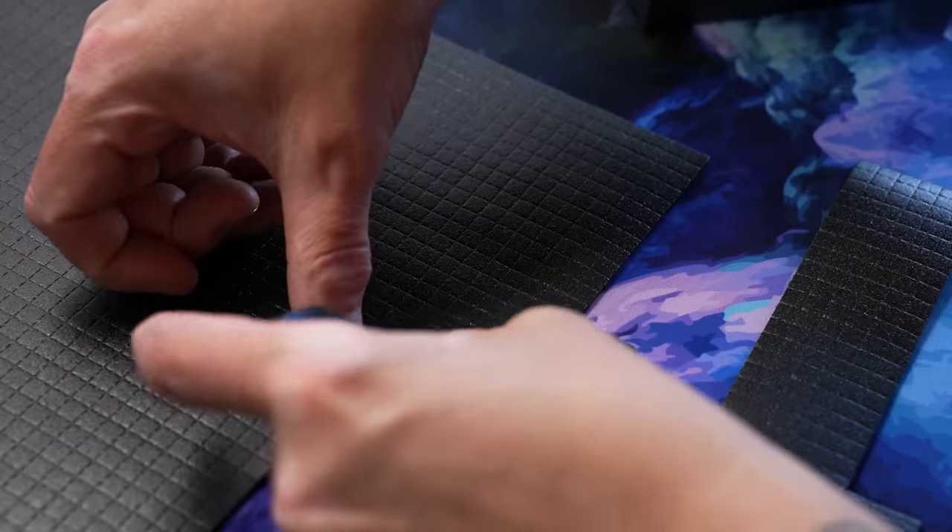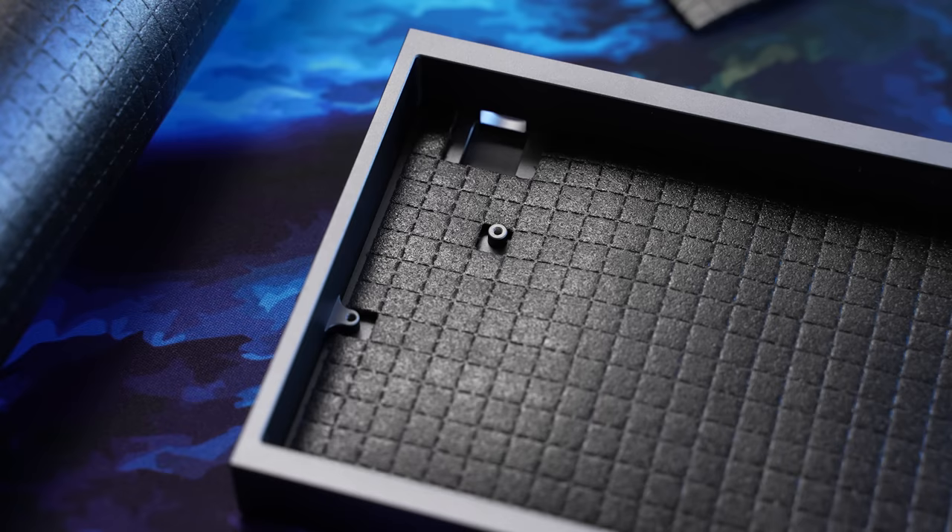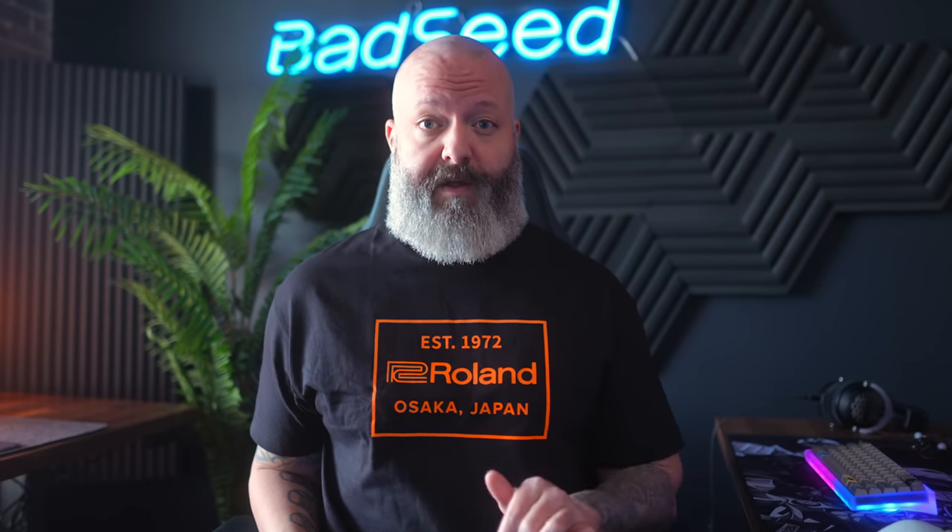I used a couple of main methods for sound dampening. The first was zip fit foam that tears apart in little squares — I did two layers in the lower cavity and one full layer in the main area. Two layers is too much to compress. The zip fit with no tape mod still sounded pretty hollow to me, so tape mod is definitely the move for this method.